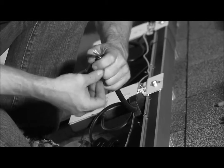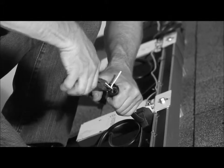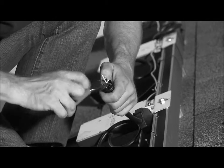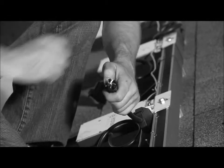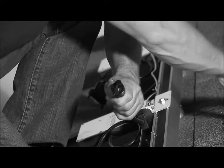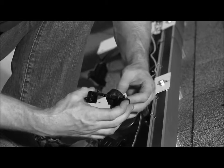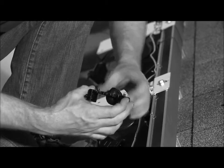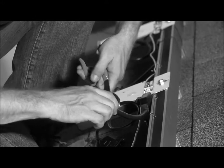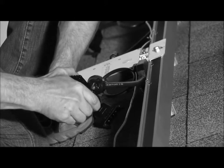Bend them all down and using a diagonal cutter, cut off the excess wire. Now you take the cap, which holds each wire against the gasket. Using the disconnect tool or a number two screwdriver, rotate the gland with your hand or wrench until the gland shelf meets the cap so that it's completely water sealed. You'll feel the ratcheting motion that tells you when you've bottomed out and achieved the seal.